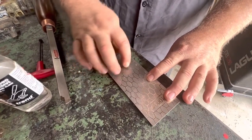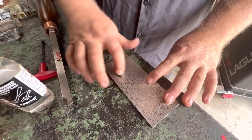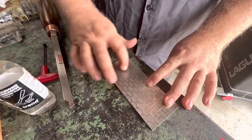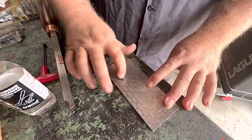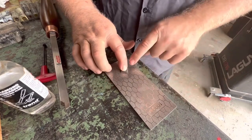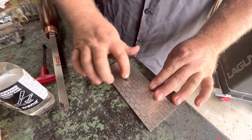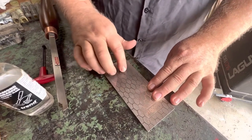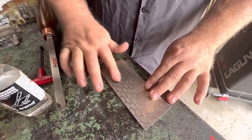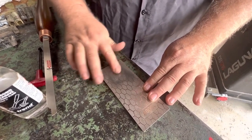I do this about 30 seconds. What you'll see — you can start to see that black grime in the fluid, and the fluid is what's pulling that away so we don't get it back on our insert. You want to see that little bit of black slurry, because that means one, you're cleaning it up, and two, you're getting down to the carbide.